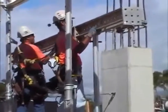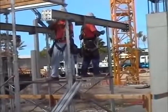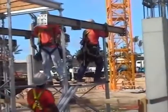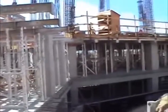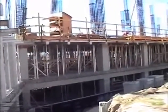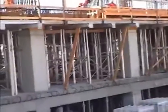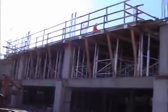Exterior dropped spandrel beams and the overhang walkway can be handled by pinning in double-channel aluminum saddles, which cantilever over past the slab edge and edge of the building. This provides a stable work area outside of the building and pins into the standard ProShore posts. Continuous aluminum joists are used for the beam soffits and walkways and slide past one another to meet varying column and beam spacing.